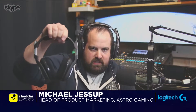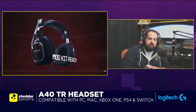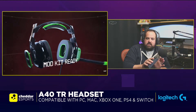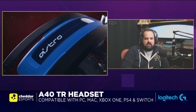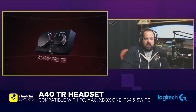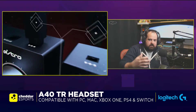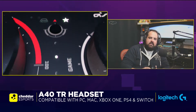All the processing for Dolby Headphone is done inside the Mixamp itself. The A40 standalone is just a two-channel headset. Via the optical cable, we take the Dolby Digital signal from the console, decode it inside the Mixamp, and then process it using Dolby Headphone, giving you your horizontal surround sound experience. We've also tuned the Mixamp for spatial audio, moving away from channel-based audio because game developers are pushing that technology forward. On the Xbox SKU, we've actually bundled a code for two years of Dolby Atmos. As platforms move into spatial audio and ambisonics, the latest A40 and Mixamp will support those new formats as well as legacy channel-based formats.